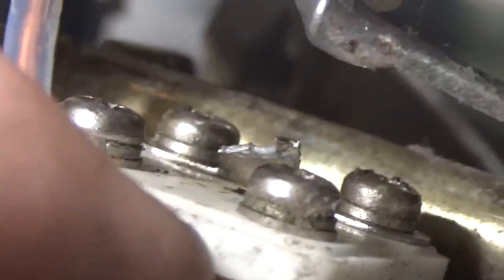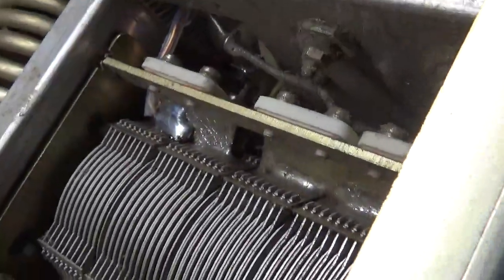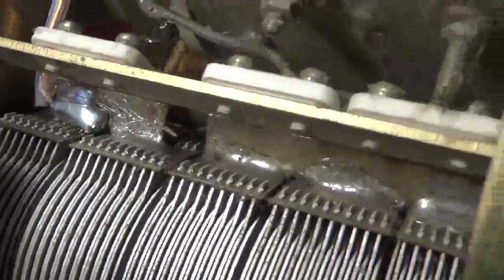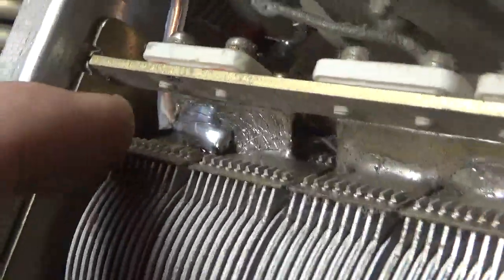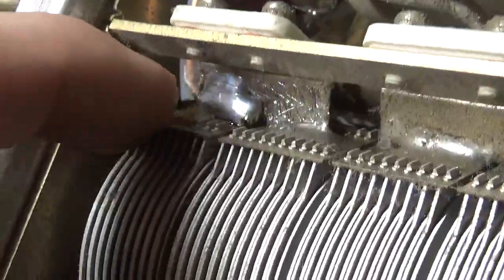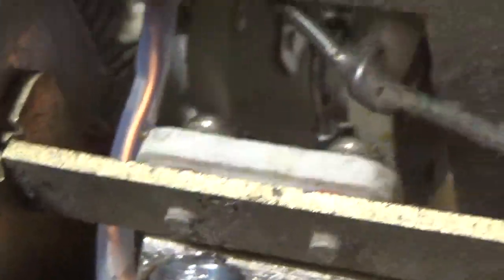He had soldered to that little nub down there of a tab. I tried taking a screw out and it just spun and spun — couldn't actually pull it out. I was lucky to get it to re-engage. What I did was when I went to tighten it, I got it to grip. I ended up soldering directly to the cap, since those screws go through this material anyway. I got it really hot and soldered right to the plate with solid copper wire. I put some Teflon over it — it's not touching ground, but I put Teflon over it just in case. It's just slightly longer, maybe a quarter inch. The connections are good.